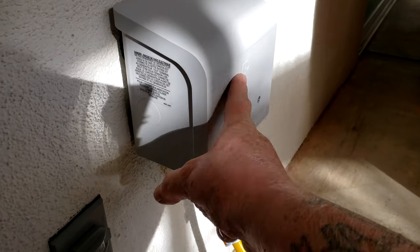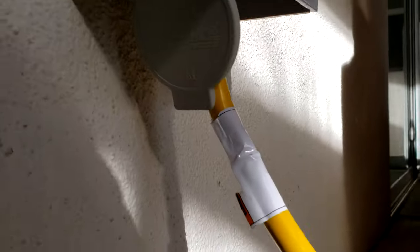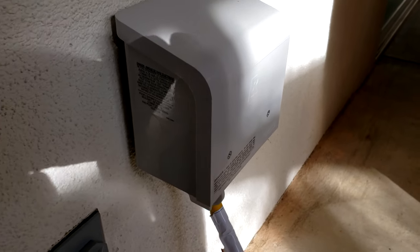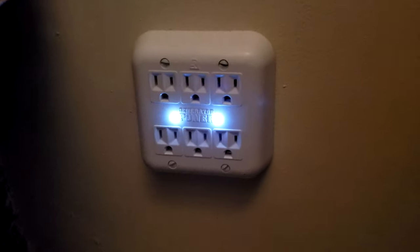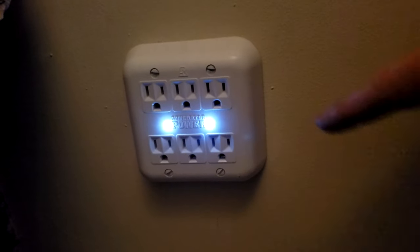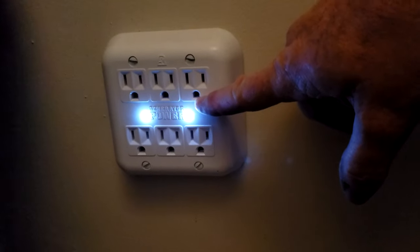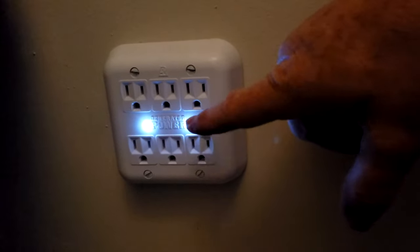On the house side, I've got this through-wall adapter for the other end of that 30-amp cord — there's no power on it normally until I hook it up. Right now there's 30 amps on here. On the inside of the house is a six-gang 115-volt outlet and you can see I have power because these two LEDs let me know I have good power from the generator. When the generator is off, these go cold. It's just an off-grid outlet — pretty handy. About a hundred bucks for one of these, and you don't have to have an electrician install it because it's not hooked up to the grid.